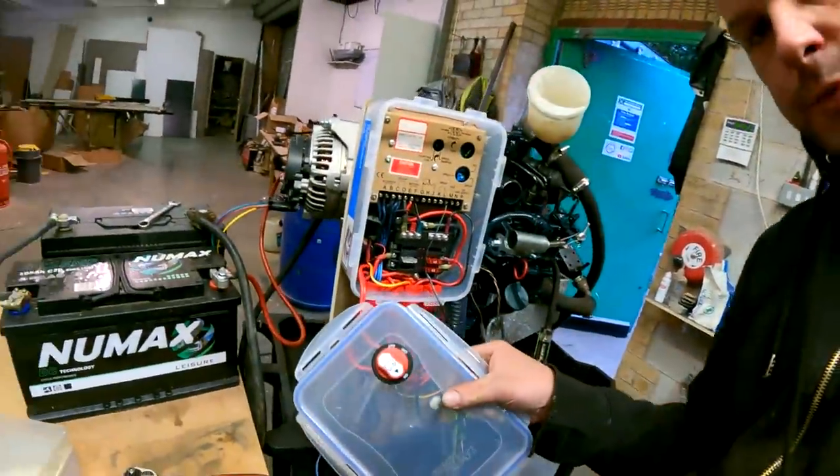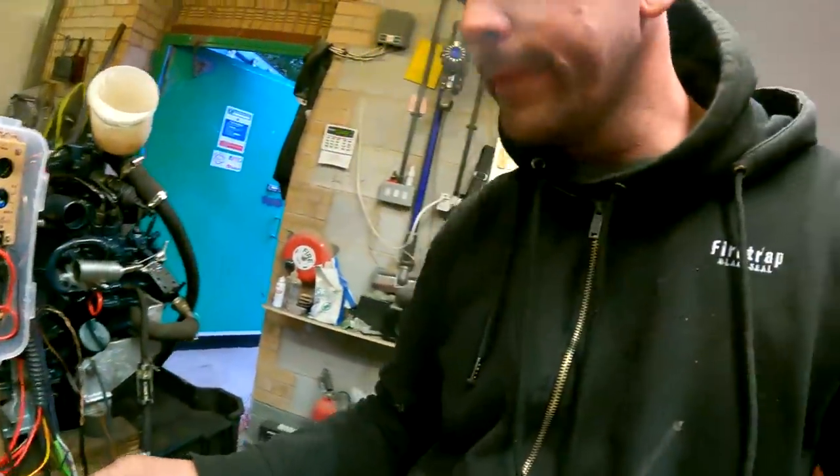I could put the engine into idle with a little switch on the front, and then it would speed itself back up. You can change the speed ramping — so you go from idle to power, it ramps up and holds an RPM. It was working absolutely perfectly until the solenoid got a bit hot, so I need to look into that. But yeah, everything else is really good.